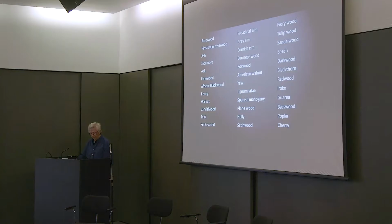Wood is resilient, and up to a point, it can swell and then shrink back a little. But it can be strained to cracking point by conflicting changes, and that is when you get uneven expansion and contraction. We need to know how the woods used in the actual sculptures respond to changes in their moisture content, and how we can anticipate and prevent strain on the vulnerable parts of the sculptures so as to avoid failure. And by failure, I mean irreversible cracks and splitting.